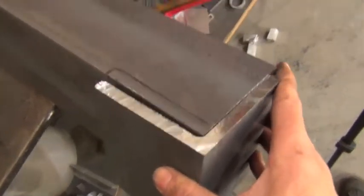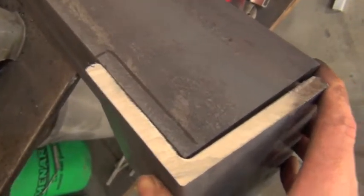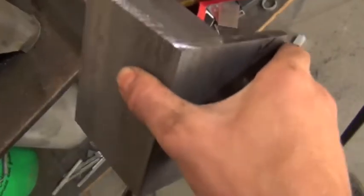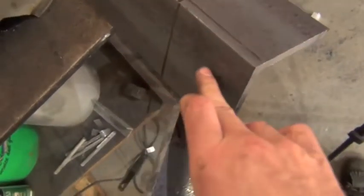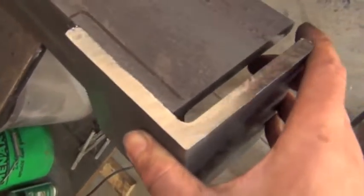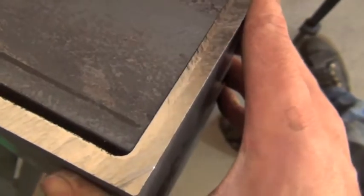The way that we need this to work out — if we just press the bottom piece of angle on like that, we have this big ugly 3/8 lip that hangs over the top. So we obviously have to trim this piece of angle so that this one sits in here level, and it's actually not that hard. All you have to do is take out a notch where this piece is gonna lay in. The way I do that is I push it up here, but you've got to be careful because of that rounded edge — you have to account for that. Push it up a little bit further, you'll have a little gap here but it's nothing to be afraid of, then put a mark down that way.